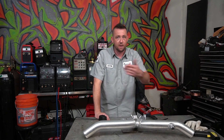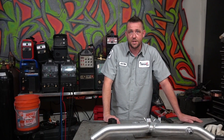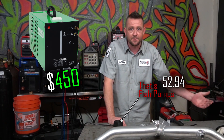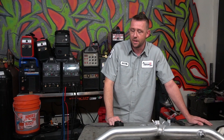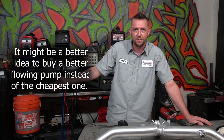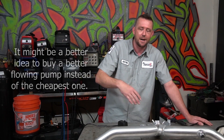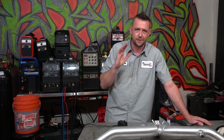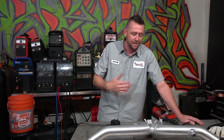I'm going to say this actually works. The price of an Everlast water cooler unit is about $450 — not too bad, very affordable — but if you have a big job and can't afford that $450, $12 will probably get you through the job. Maybe invest in a pump with a little better head pressure that will push through the torch. A $15 to $20 investment to get you through a job that then buys the water cooler for the next job — that's a pretty awesome deal. Consider this a short-term solution; don't put your whole workload on a $12 pump, but in a jam, this will definitely do it.